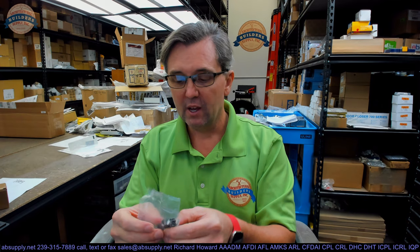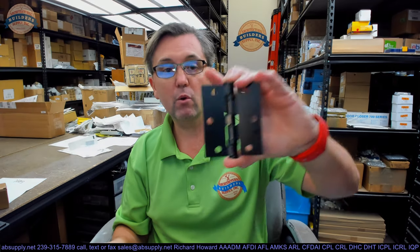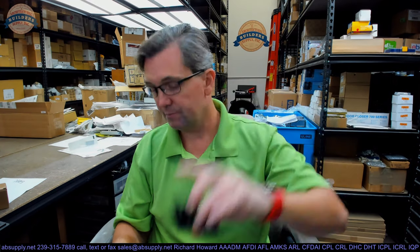Indicate in the comment field what the composition is of the door and frame, so the onus is on the factory to package it correctly. I told the factory I wanted all machine screws and all wood screws, so they've sent me six of each, so I can't go wrong. Whatever the client's doing, I'm covered.